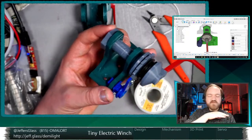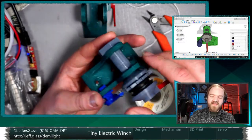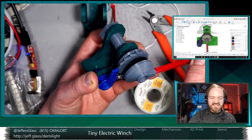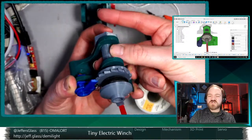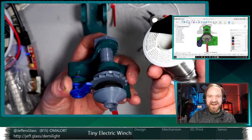It's too sticky. I've filed it and sanded it nice and smooth. I oiled it with a couple of different greases and oils, and there's just too much friction there. If I'm cranking it by hand, the extra force of my cranking is able to overcome it. But in coming back down, even when I took the handle all the way off and took the ratchet off, just the friction of barrel on frame meant that the solder was just hanging in the air forever.